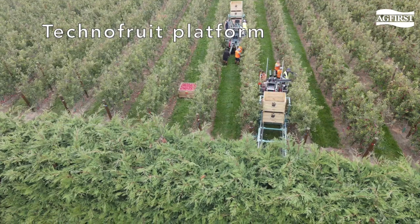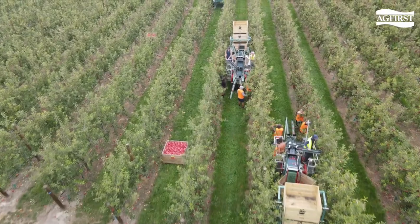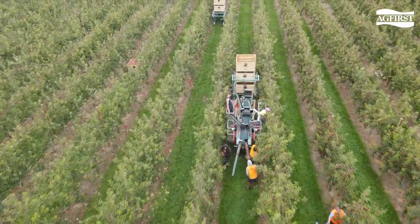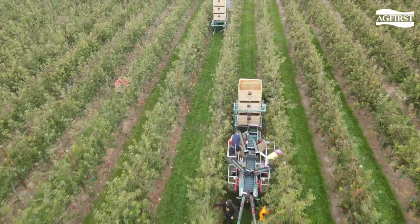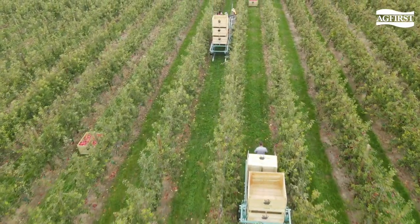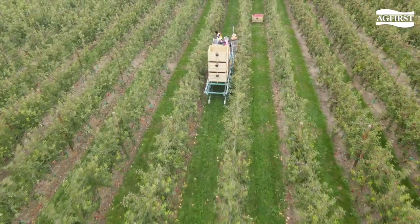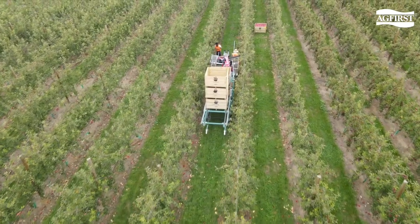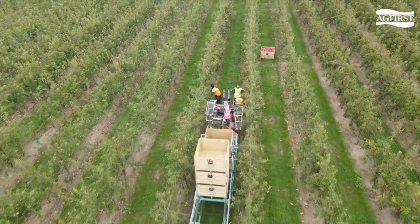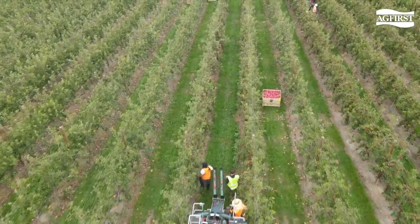And finally, we're going to look at the Techno Fruit platform from Galaxy Group. It is very similar in configuration to the Revo platform in terms of its picking conveyors and rotating bin filler. However, the Techno Fruit operates on a bin trailer rather than picking up the bin from the front and emptying it out the back, as seen in the Revo example. The bin trailer can carry a total of 12 bins, with the empty bins being loaded onto the top level and the full bins being emptied out on the bottom level.